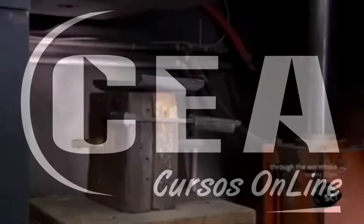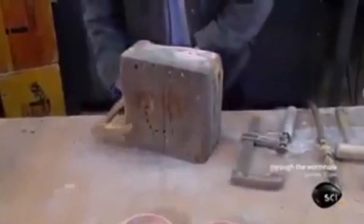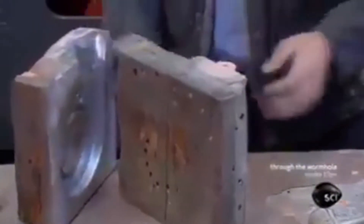Production begins at the foundry. An overhead sprayer blows sand into the shaped cavity of a box. The spraying action activates a binder applied to the sand, causing a chemical reaction that solidifies the particles.